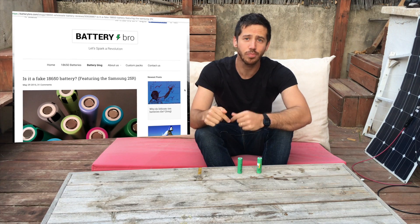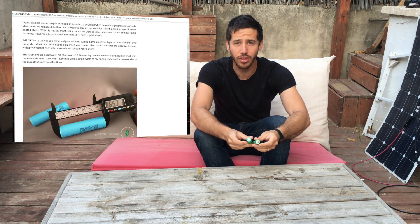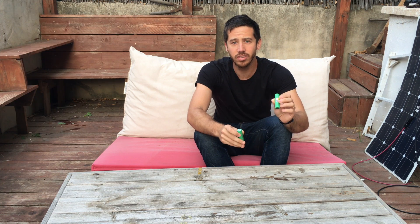There are a number of physical tests you can do. There's a great article by Battery Bro that I'll link below that goes through all the physical tests — you can weigh these, compare the shrink wrap, check the top where the vent holes are. These check out; they've got three holes, just like Samsung 25R cells should. You can go through all those physical checks, the coloring, that kind of stuff. These Litokala cells check out in that respect, but you should definitely read that article to see all of them.